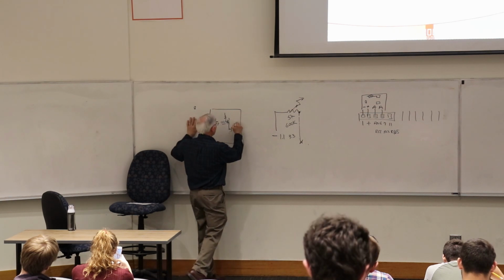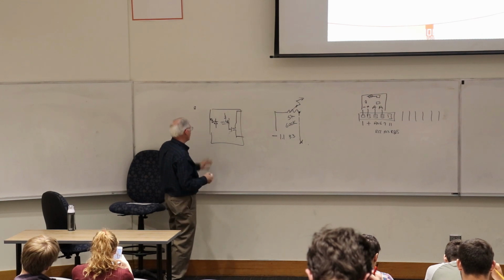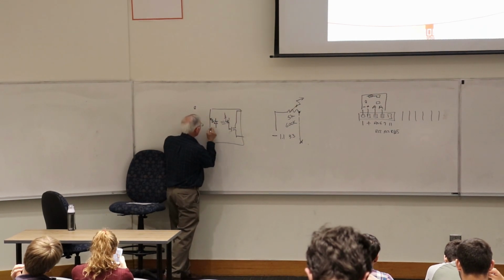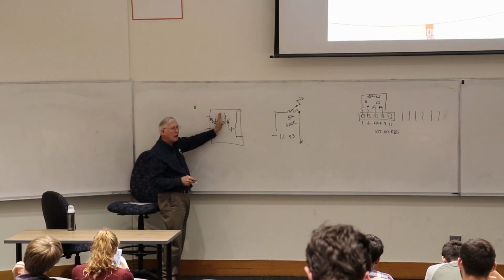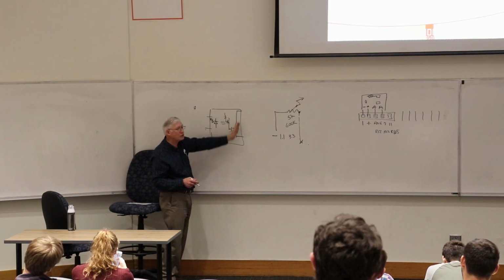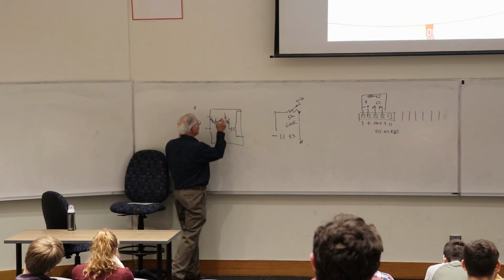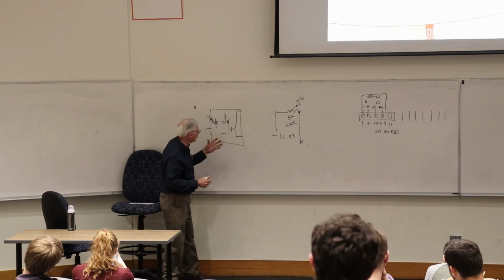And so then this FET may be driving some higher load. It's obviously more complicated than this, but the whole idea is that this circuit over here, which is your low voltage circuit, all it does is turn on this LED. And then light shines across a physical gap, an air gap, between these leads and the leads over here. And this air gap, maybe it's a centimeter or so.